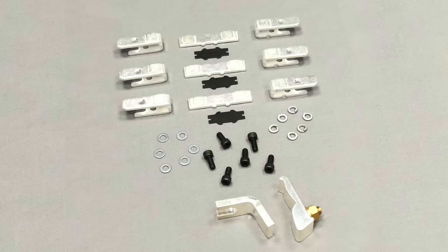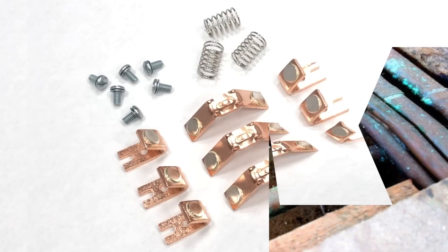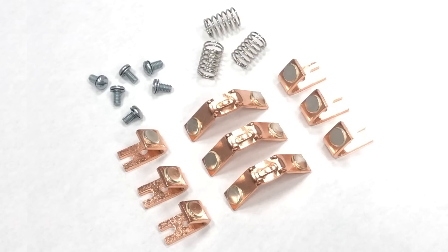Please notice the silver plating on both the DC and AC contacts. The reason this is done is to help prevent the formation of copper oxide, otherwise known as green rust. Most kits have this, but some don't, like the three-pole Repco replacement for the size 4 GE 100 200 300 series.